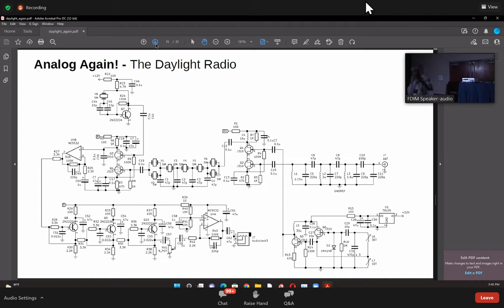Very stable as well. And you will see that I've used these polystyrene capacitors. A lot of people go around trying to search for this stuff. Actually, it is available from Mouser, and these are used a lot in audio amplifiers, which is why they are also available to us. That apart, if you can handle SMD, there are SMD 1206 capacitors available. They are as easy to handle as a 1/4-watt resistor, because a 1/4-watt resistor standing like this is about the same width as a 1206 SMD capacitor.